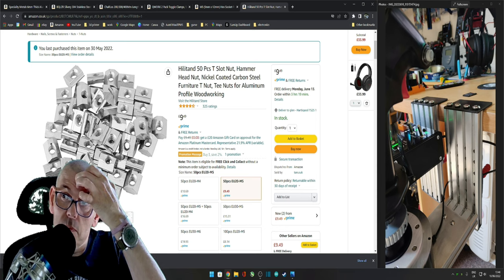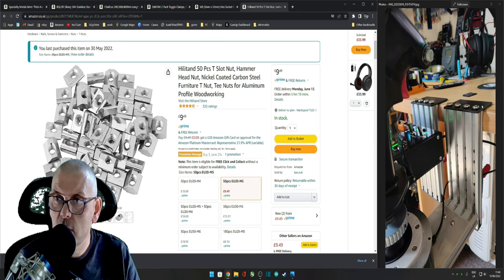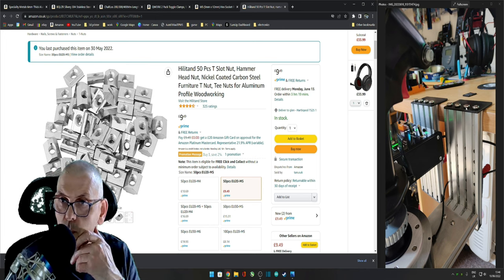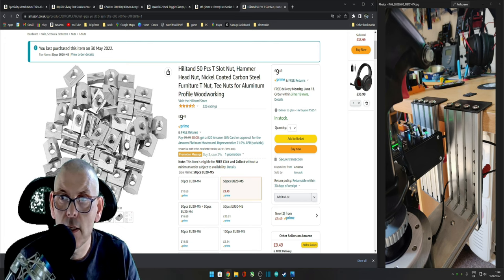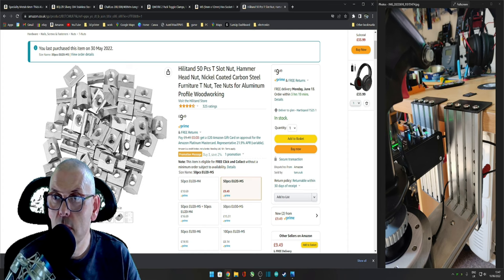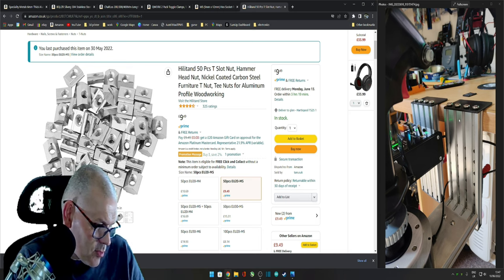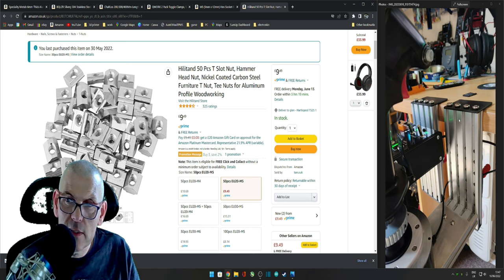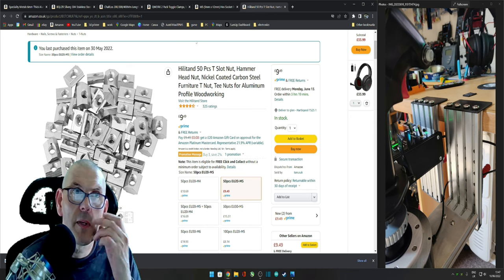The top part is two pieces of mild steel plate. I wanted aluminium, but I didn't have any, and I didn't want to buy a full sheet just for that. So I found some mild steel, 3 mil I think it is, thick. And I just cut it on the bandsaw and drilled it out. And the black, I flapped it up with a flapper, so it was all nice and clean steel. I cleaned it with alcohol, and then I just used gun metal black to turn it that color. It's a really nice finish, actually. It's hard to explain, but it's super smooth and jet black, and it's not paint. I didn't want to paint it. So yeah, that's it really. That's all the bits to buy.